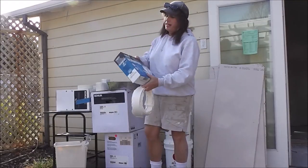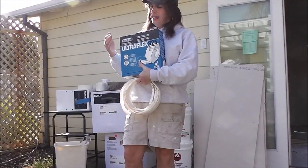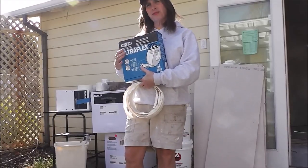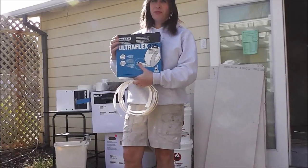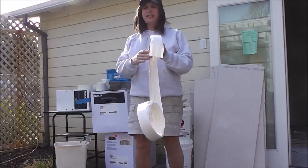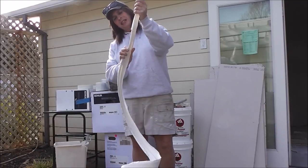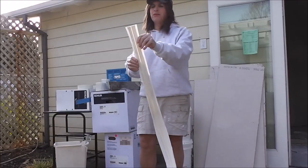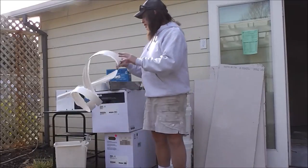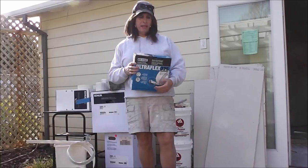For doing corners, I found this thing called No-Coat Ultra Flex, and this stuff is fantastic for making inside corners. I still like to use metal tin outside corners for walls and things, just for the extra strength that the metal and spring steel gives. But for doing inside corners, this stuff is fantastic. It's firm but you can bend it — it's a very rigid product with plenty of flaps for drywall mud on the side and great adhesion to stick into corners. It's really expensive though — $50 for 100 feet — not cheap, but really great for making good corners.